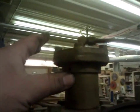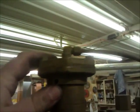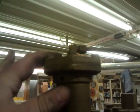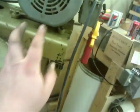Let's see if it's leaking — yeah, a little bit. Well, if that's the only thing wrong with it, I still got one hell of a steal. This thing was cheap. Like I said, I just need to replace the pressure switch, mount a new magnetic starter, wire those all together, and put the belt guard back on.